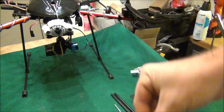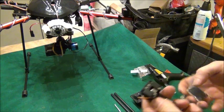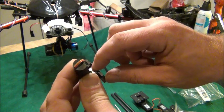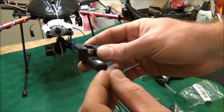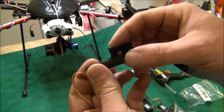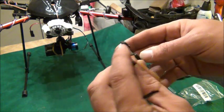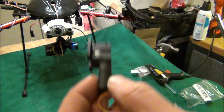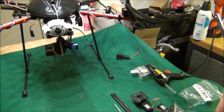They also make a smaller one — it's also self-contained and I think it's for three millimeter wire. So you have options: if you're going to put retracts on a Phantom you definitely want to go with the smaller one. I'll post a link — these are available in the US warehouse, they're like eight to ten bucks a piece, not bad at all. I'll show you guys how I put my retracts on mine.